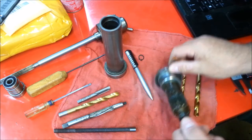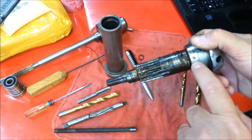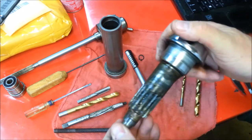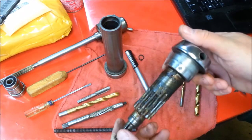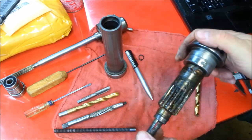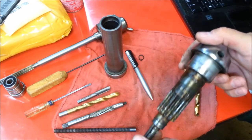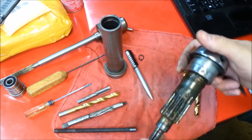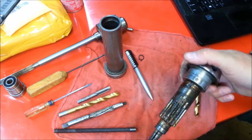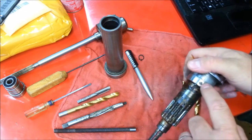This piece and this piece are separate — this is steel, this is zamak or cast aluminum. We have a pin driven in here, and it'd be nice to go on the other side and drive it out, but it's a blind pin. So I have to get that pin out of there if I want to just chuck this part up in my three-jaw chuck. I really need to go ahead and try to get that pin out. I think I'm going to drill this and tap it for 4-40, to try to pull it out that way, and slightly move this part inside so it's not pressed in tightly.